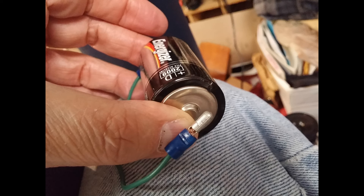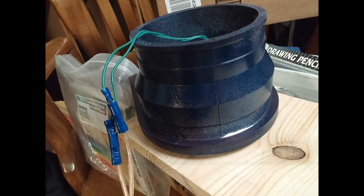I used all green, but with appropriate offsets so that it's easy to get the polarities matched up properly if I do have to detach them. Here are the connectors I used — they're a push-together type connector which is very firm and very snug, yet can be pulled apart with jiggling and pulling with your bare hands; no tools needed. I like how they worked out — it makes it easy to work with the various assemblies while apart, and get them clamped together once the final assembly is complete, with a nice firm reliable electrical connection.